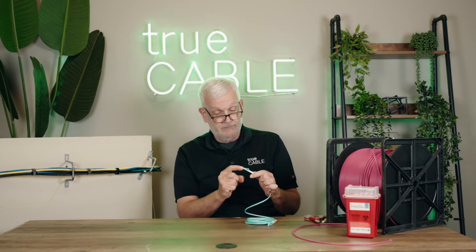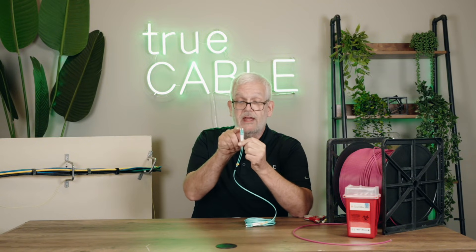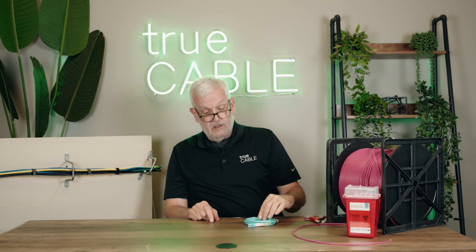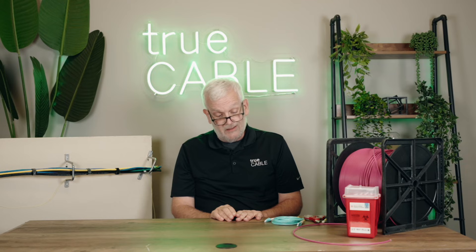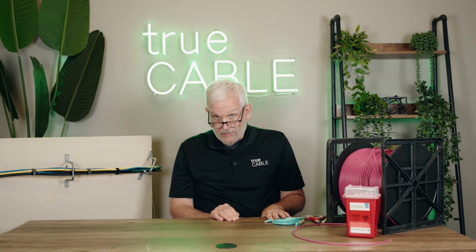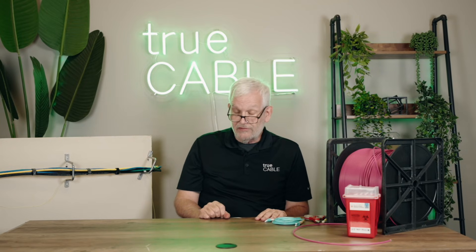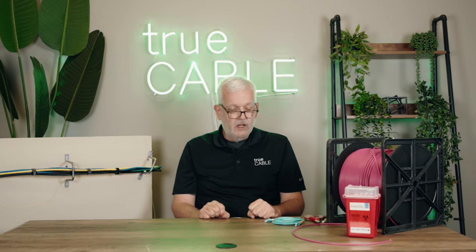If you're working with fiber and you have an uncovered end face, don't look directly into the end face. You don't want to look directly into the end face if the fiber is energized. The problem is you can't tell by looking — the fiber signal is not in the visible range of electromagnetic radiation, so you can't see it. Nevertheless, that frequency of radiation can do severe damage to your retina. If you're on one end of the fiber optic cable, you're probably not on the other end and don't know for sure if it's energized or not. Even if somebody calls you on the radio and says it's not energized, it's not worth your eye to trust them. Never look into the end face.